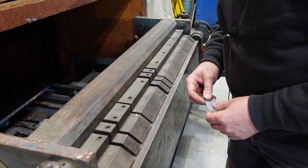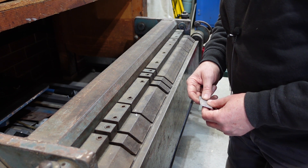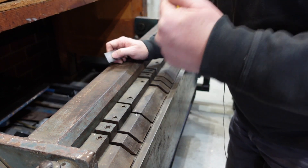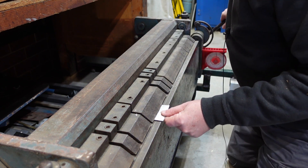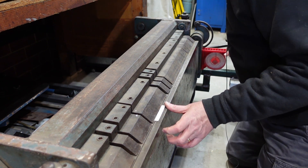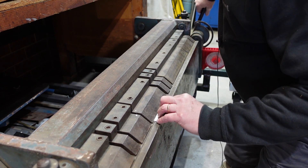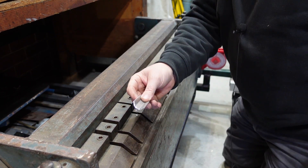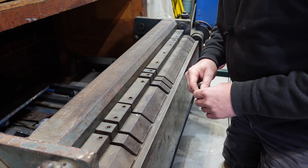The other question was why did I make the legs for my little stand in halves. The reason is that to make something like that on a folder like this, there's no room. So it's easy to make it in halves and then weld it together. Doing that was actually pretty straightforward — when you start with the outside bend and then move to the next one in, you can produce quite sharp bends as long as you've got enough material to clamp on and enough material to get on the leaf.